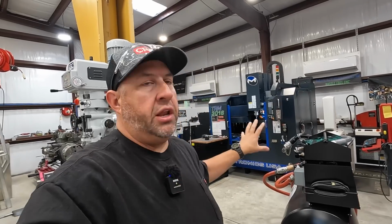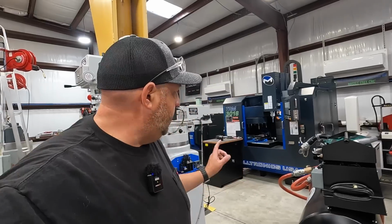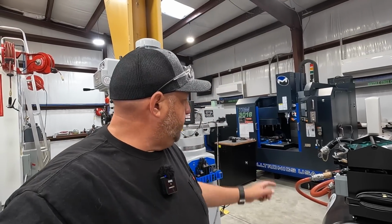to the wall there. It's a really nice system, and I'll show that to you, where I can literally go over to the hose reel, grab the hose, pull it over to whatever machine I want, and then turn the ball valve on, and it mixes the water and the coolant together right into the machine. It's a really simple process, so I'm going to share that with you too. So we're going to go ahead and get busy getting the coolant out of there.